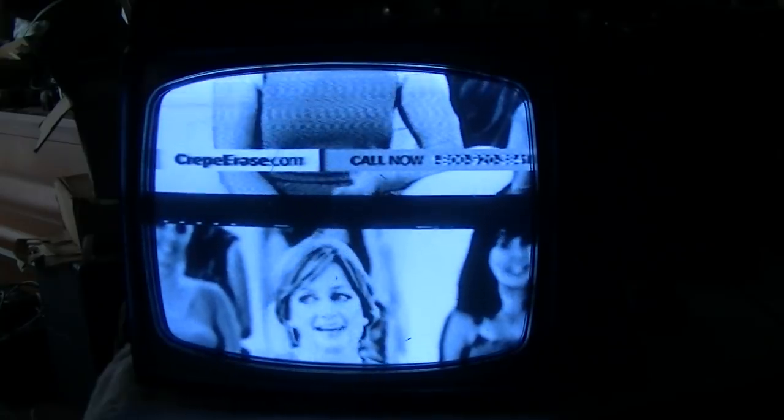Okay, let's rock the crepe erase here for a minute. It looked like this in the first video and I chalked it up to bad filter capacitors. And filter capacitors did change some of it. It fixed the vertical. I haven't adjusted anything. But we still have this kind of overloading, low quality picture. I thought it was the capacitors. Well, that teaches me. There we go again with proof that capacitors hardly ever correct everything.